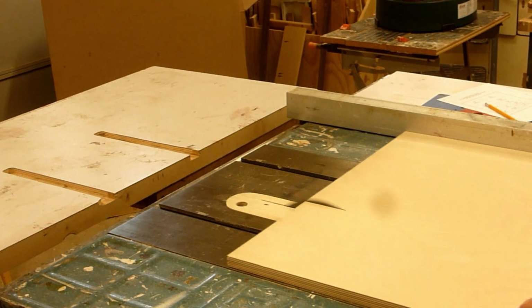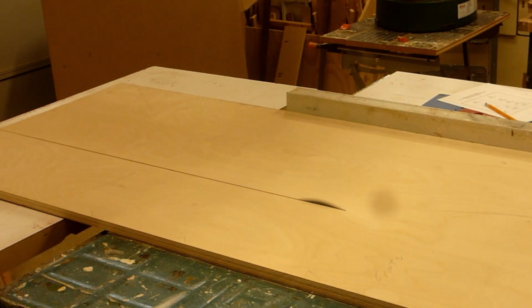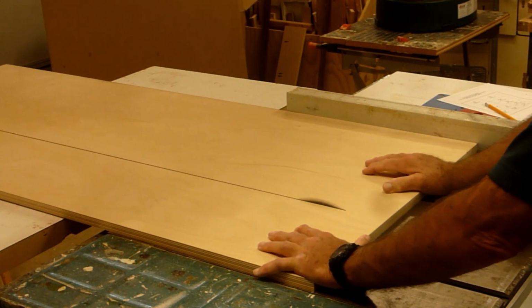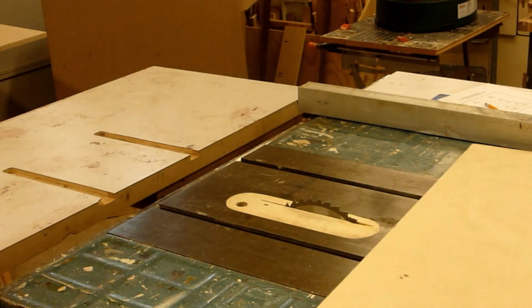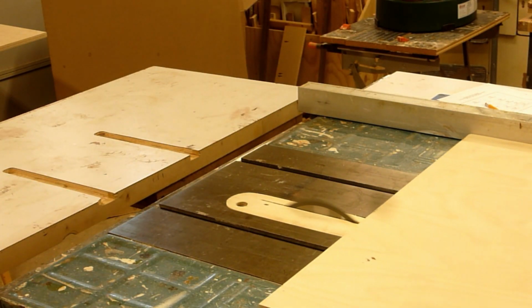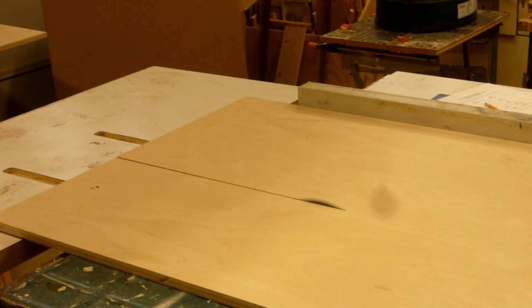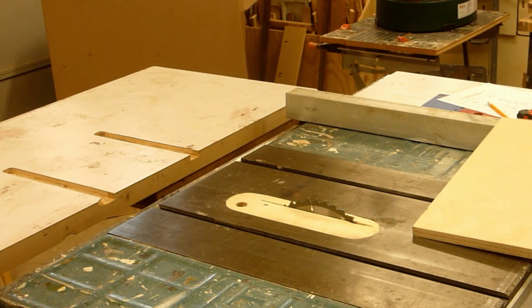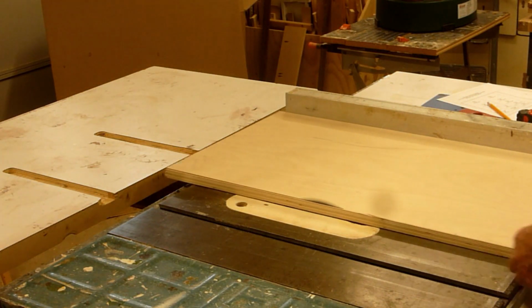Okay, let's get started. I like to make all my widest rips first. Set the rip fence depth and make all your rips of the same size in sequence. That way they will all be cut to the right width. Remember, the factory edge is usually straight, so first position it against the fence and make your cut. I usually rip the board slightly too wide, then reset the fence to the exact measurement, then turn the board around and rip off the factory edge. Hopefully we will remove any dings or damage done in handling that way.